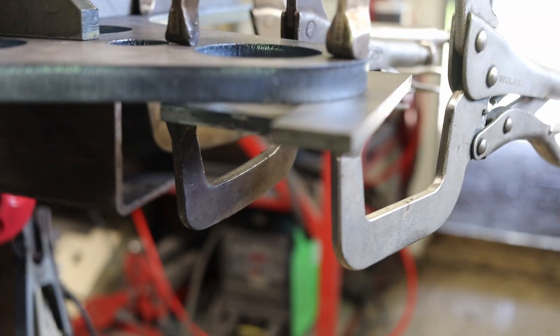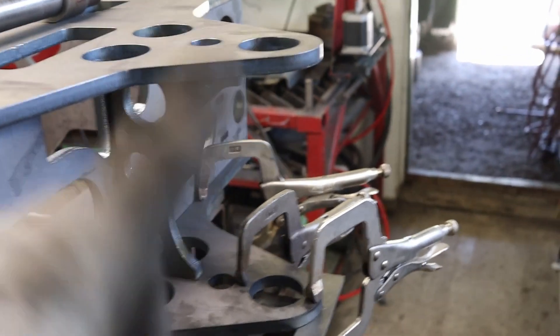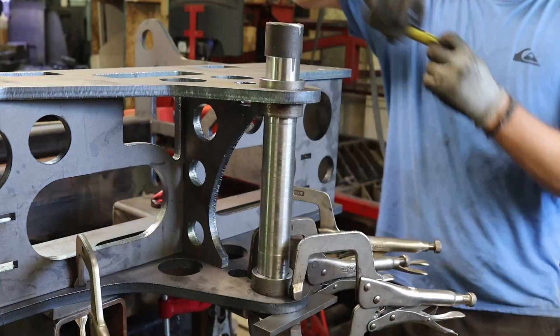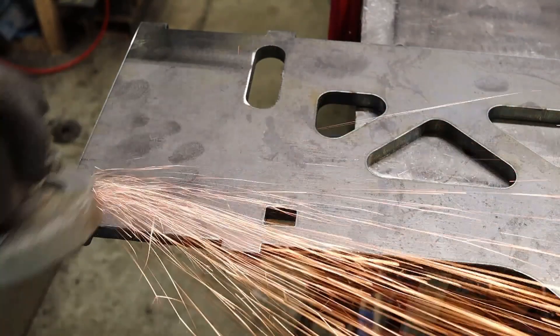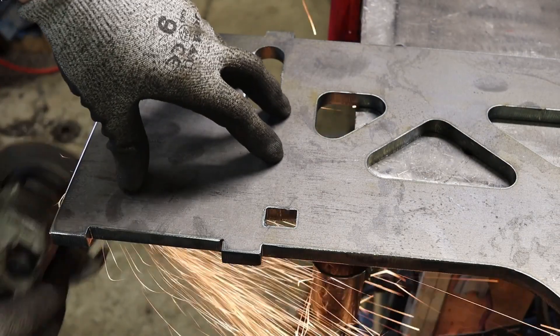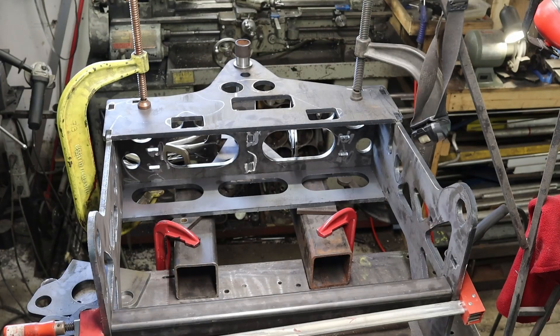I put some quarter-inch shims and a bottom plate, and now I can slide in the two bushing housings with the dog bone. I might be oversimplifying the assembly process of the base, but with the mortise tenon I put in the design, it's really simple. Keep in mind though that I did need to prep the parts a bit, because even if the laser cut quality is pretty close to perfect, sometimes it will leave a small burr, and with that, the parts won't align properly.